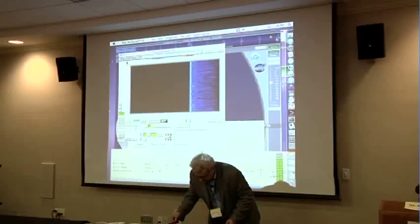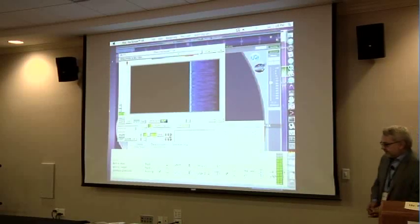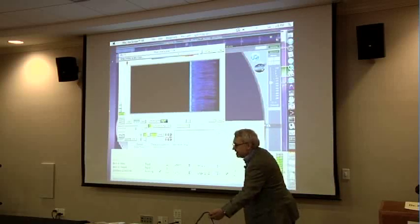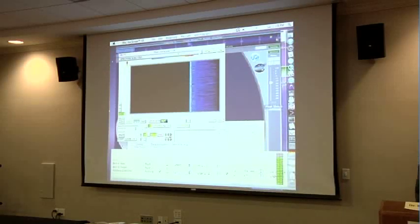Is the cartridge picking up this noise or the unit itself? No, it's this cable, yeah. And actually, at this level, it's a very sensitive analyzer. This is 80 dB down. So you would never hear that anyways. But it bothers me, and I wouldn't consider that acceptable. But for this demo, it's okay. There's all kinds of noise around here. All right.